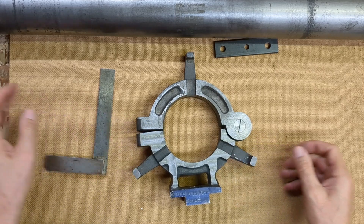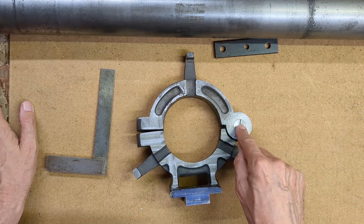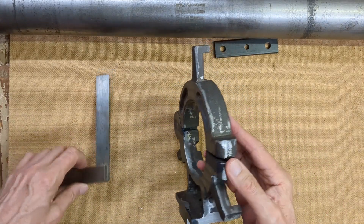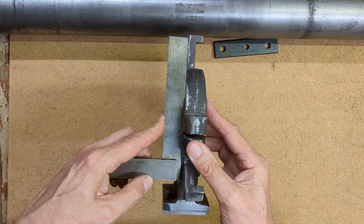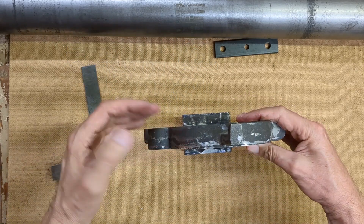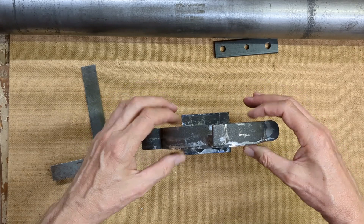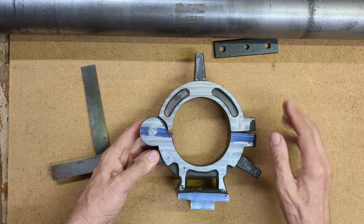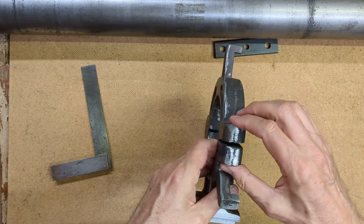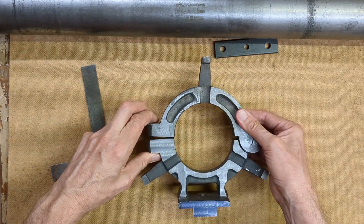I'm planning the next operations and what I need to do is to produce the split line here, which of course will come on the center line of the pivot. The other issue is that because of the way I've made this there is a slight malalignment between the two halves. Reassuringly, it's not because the hinge is out of alignment - it's just that the thicknesses are not consistent, so this lower piece is slightly thicker than the upper piece. I think a better plan would be to complete the hinge so that I can use it to clamp this together, and then use that clamping action to hold everything rigidly.